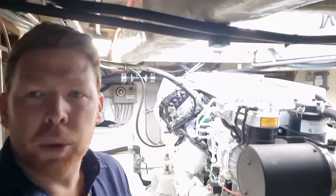The Cursor 16 weighs in at just under 1700 kilograms dry weight, so plus fluids and gearbox it totals about 2 tonnes in a vessel. With current AMSA requirements of under 4% weight variation for a heavy ship, it's really important to stick with a similarly weighted engine. The Fiat Cursor 16 at 1000 horsepower, commercially rated for 1000 hours a year, fits that bill well — whether replacing a slightly heavier or lighter engine depending on the vessel's requirements.